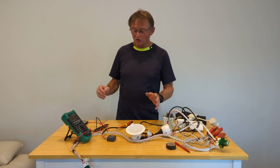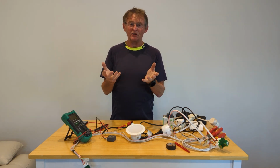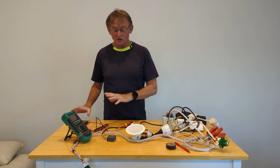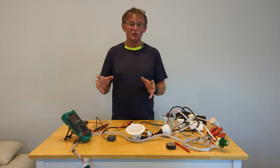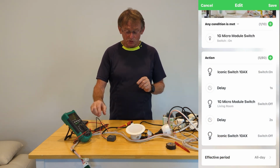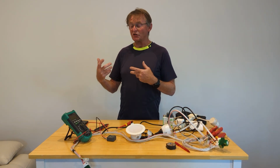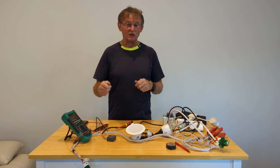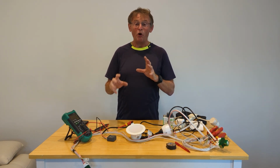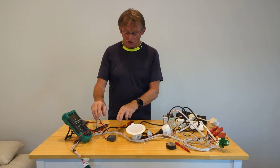Okay, so what we wanted to do, we wanted to make the relay output be giving on for a pulse. So what I've done is I've written a program to do that, to give a 3-second pulse. Now one of the important things to do is you're going to trigger the relay somehow. It can be either via software or via a push button switch. And then you need to turn the relay off so it's ready to accept the next trigger on.